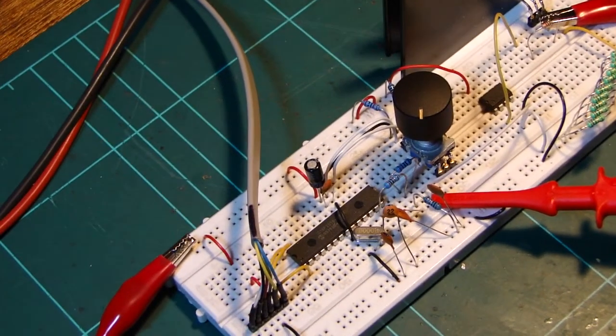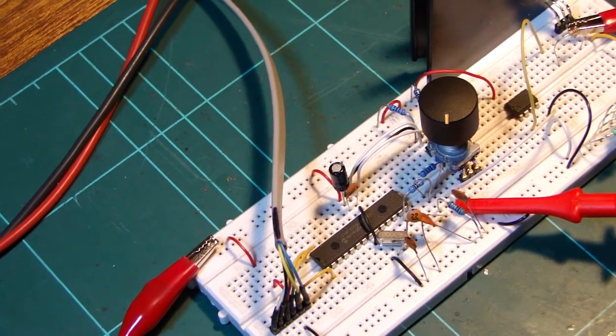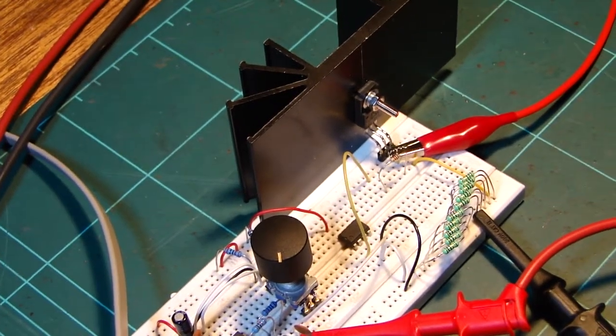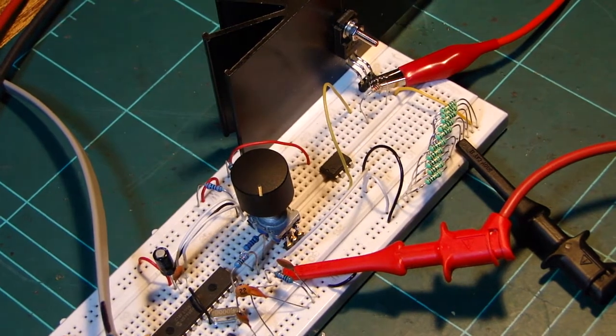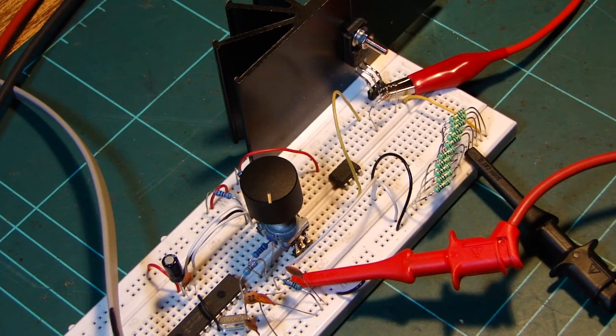As you can see here, there's a rotary encoder and a PIC that's generating a PWM signal, which is going to the op-amp, which is controlling the power Darlington. And there's the 10x10 ohm resistors that are making the 1 ohm current shunt.